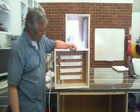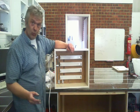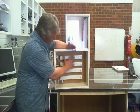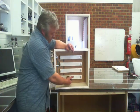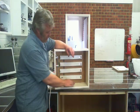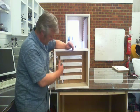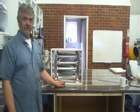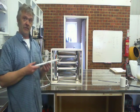The only thing we need to do now is put the lamps in, but it would be made slightly better if we put a reflective coating on the inside first. If you put something reflective — like aluminium — then any light going behind those lamps will be reflected back onto the surface and give you a better result. So an option is to put a reflective surface on before you put the lamps in. Here's the lamp all finished — I've put aluminium foil reflectors in place, and most of the lamps are installed. This is a direct replacement for the lamp we took out, apart from the fact that these are ultraviolet.